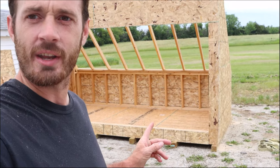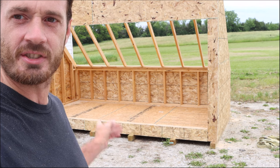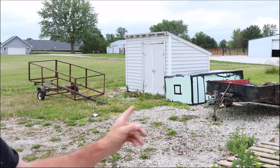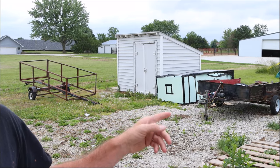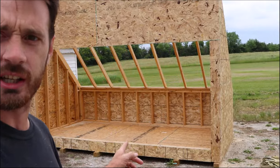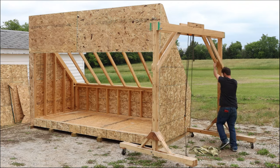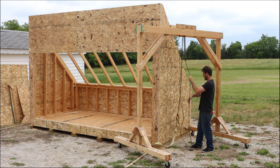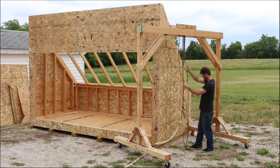I'm not willing to admit I've done anything wrong yet, but whatever the voiceover told you to do earlier is definitely what you should be doing. I have to figure out how to get insulation underneath all of this — it probably would have been easier before I put all the framing on. This is the poor man's kiln, and I'm going to be harvesting the insulation off of it to fill in under here. The right thing to use would be 1-inch foam insulation installed between the runners of the floor before putting the OSB underlayment down — unfortunately, I completely forgot that step.